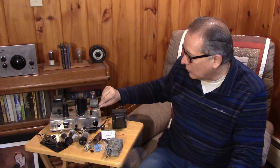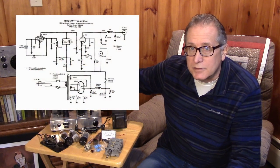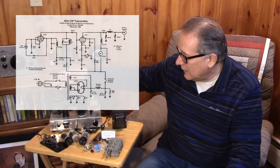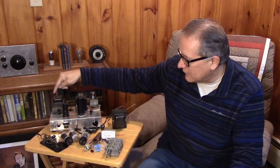This is a little transmitter that I built several years ago for 40 meters and 80 meters. It takes plug-in coils, has a 6L6 in the output, a 6AG7 crystal oscillator, and a VR150 for regulation. This thing was very crowded on this chassis — it's a very tight build. The power transformer is fairly small, so that limits your output power. The 6L6 can't do that much anyway — perhaps 50 watts input with a larger transformer. With this one, I do about 35 watts input.